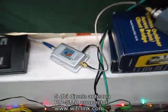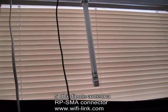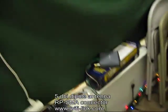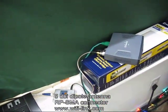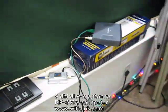When you're adding an amplifier, such as this one, with a bigger antenna that can handle much more wattage, what you're really increasing is the reliability of the coverage — you get less dropped signals and you get disconnected far less.